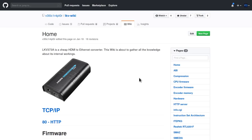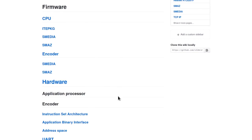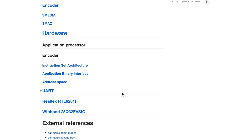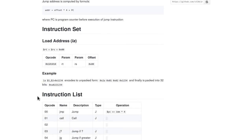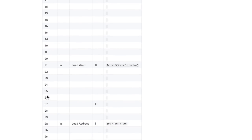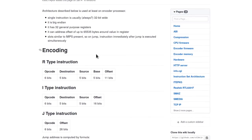One of the most exciting new developments is this wiki which a guy called Velociraptor has started. He's done a bunch of research reported through the wiki and a series of blog posts, uncovering a lot of hidden information about how the Lenkeng HDMI transmitter actually works. He's done a bunch of reverse engineering to uncover the structure of the firmware files and tried to figure out more about how the CPU core inside the SoC actually works. It turns out the CPU core is nothing common — not MIPS, ARM, or anything like that. It seems to be an ITE custom processor, and he's had some success figuring out how the instruction set architecture works and decoding it. A lot of the opcodes are still unknown, but it's impressive that he got as far as he did — he's even written code for a disassembler so you can decode the binary.